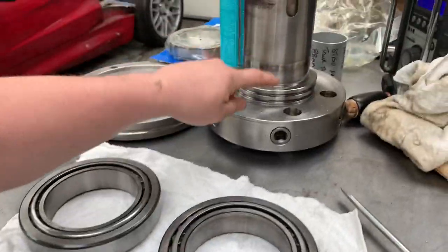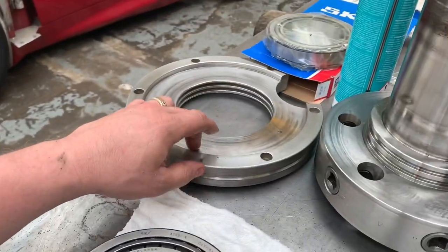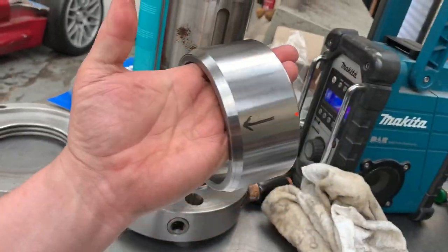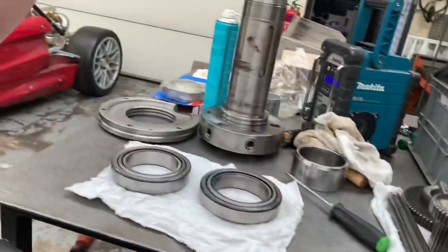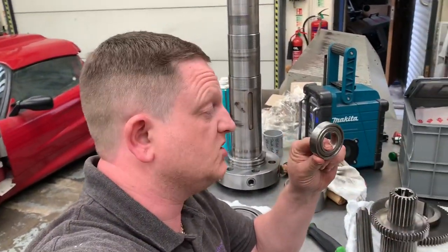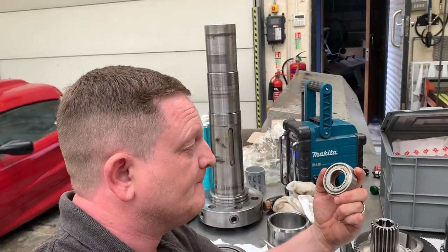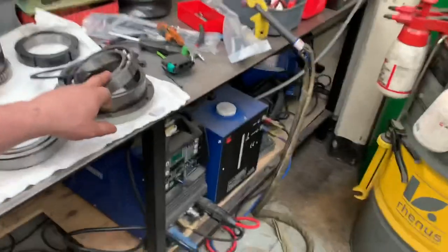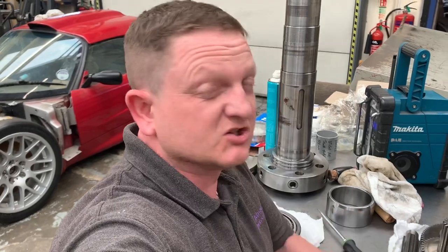So we've got it removed off of this. We had to take it and put it upside down on a bit of wood on the floor like shown in the photo, and we actually just tap the plate off and this main sleeve here which comes off of it. So I'm going to get all this cleaned up properly and laid out ready to go, and then hopefully the four of these new bearings, there's one slightly bigger, these are 6206Z, there's four of them required. There's a 6207Z, one of them required, and the replacement for this bigger bearing here. Hopefully they'll be here tomorrow morning, because I paid for Saturday delivery, because I just want to get it put back together.